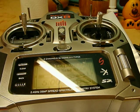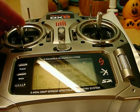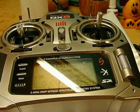It does it alternately, so I'm unplugging the power and plugging it back in. Waiting for the musical tune — as soon as I hear it, I'm going to put the throttle low. I only get about a second. There's the tune. Two bleeps after the tune now — it's registered that I've done the throttle low, and that tells me the brake is now off.